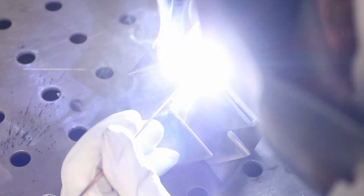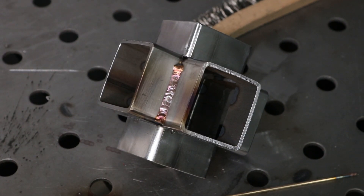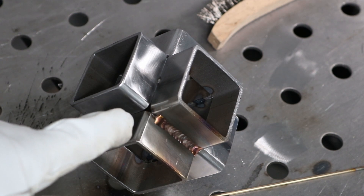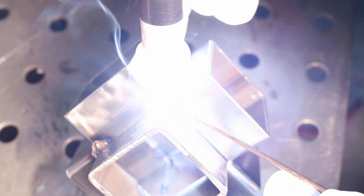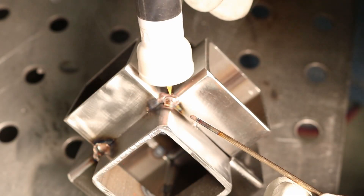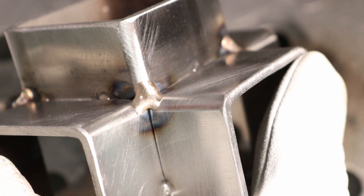For this first braze joint, I'm going to use some pulse settings — I'll put all the settings down in the description below. I just used the lay wire technique with pulse and it came out okay, but not quite what I was hoping for. I was thinking I'd go ahead and fill those holes in the corner next, so I have something to work off and onto. I just heated up the material and brazed from the corner of one piece down into that groove. Watch what happened here — right there, the filler metal balled up because I got it right into the arc, and you don't want to do that. What you're trying to do is get it right into the pool and the hot steel. There's a little bit of oxide I'll have to clean off.